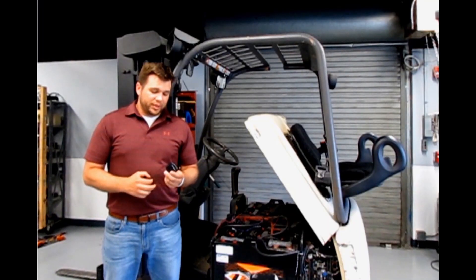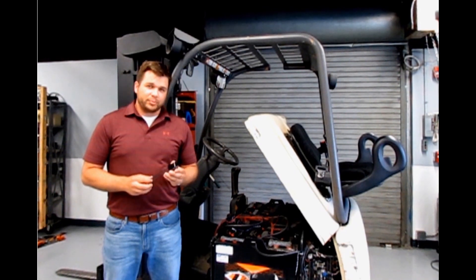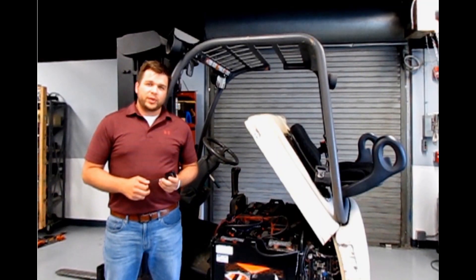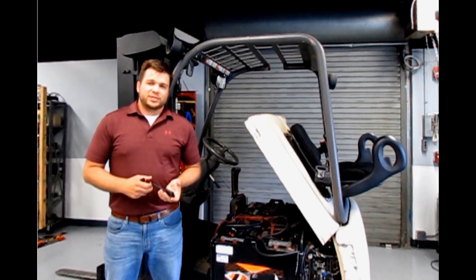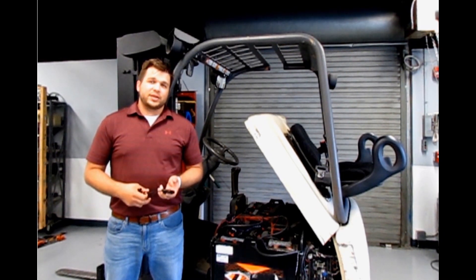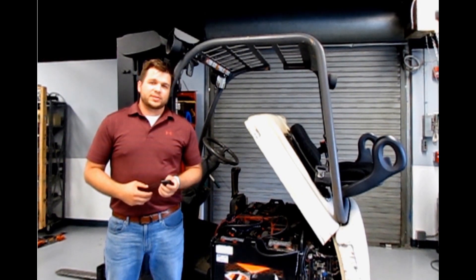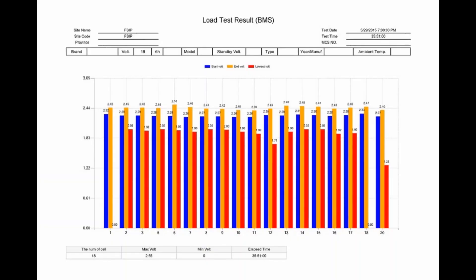I have here one of our BMS sensors, or battery monitoring sensors. What this sensor does is speak via Bluetooth back to our integrated monitor software, taking voltage readings of either the cell of a forklift battery like we have here, or on the battery of a golf cart or scrubber sweeper. This is very helpful in determining whether we have mechanical damage within that battery or cell, or whether that battery or cell does need to be replaced. When that does speak back to our software, it communicates and gives us a very detailed graph determining the health of those cells.